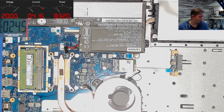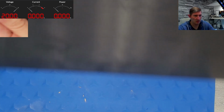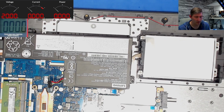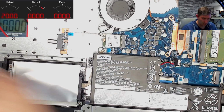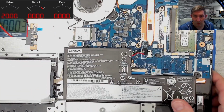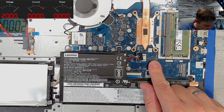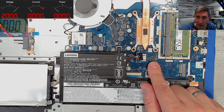So yeah, all voltages are coming up, stay for a while, CPU changes the voltage, and then it is stuck in a boot loop. So yes, it can be a BIOS issue, and for this reason we rule this out now. Nothing obvious to notice. Power rails seem healthy. Here's a BIOS chip. I need to source a known good BIOS, and then we'll see.